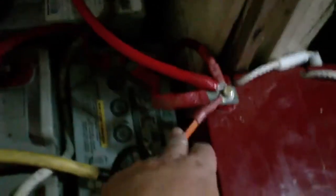Well, I use it to describe the way I've deliberately run these batteries through relatively light gauge cable a couple of meters all the way back into the shed to the battery bank. I think I've shown this a bit before too, where they're connected here. And what that will do is it will deliberately cause these batteries to take less current when they're charging and contribute less when they're running the load, at least initially, until these other batteries are flatter.